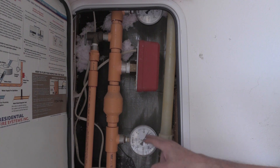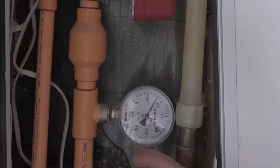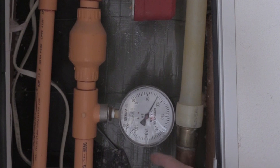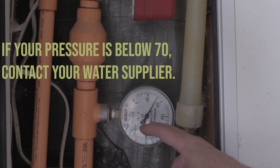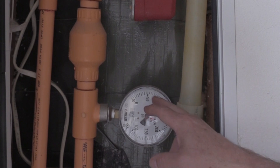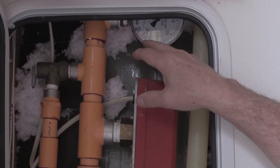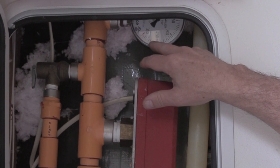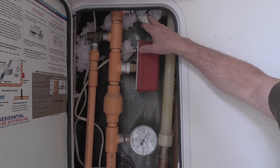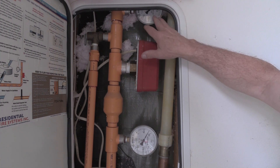While the test is running, come check your pressure gauges. You'll have two gauges. The lower gauge measures the pressure from your water supply line — from the city or county or whoever your water supplier is. You can't really control that, but you do want to see numbers between 70 and 150 PSI. If they're outside that range, especially on the low end, contact your water supplier — there may be an issue in their pipes. We're good here at about 75. The upper gauge measures the pressure going from the system into the outflow; that number should be about the same as the city supply line. At night when no one's using water the pressure might go up a little, then even out during the day. If those numbers are not in line, you want to have a professional take a look.